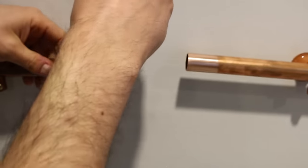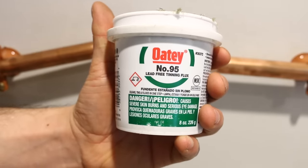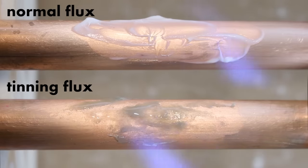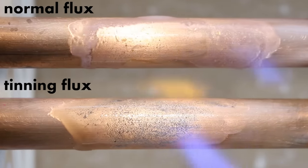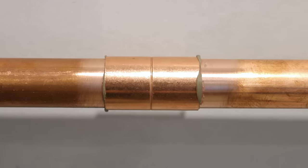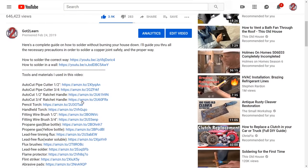Then comes the fluxing part. If you're just starting off with this technique I suggest using tinning flux. Tinning flux will give you better coverage as it contains solder powder in it — I gave a side-by-side visual in one of my soldering videos showing the difference between both. The tinning flux itself will cover a good part of the joint without even adding solder, so consider it cheap insurance. Once the flux is applied you'd assemble everything together. If you want to use the same materials as me, everything I used is linked in the description box below.